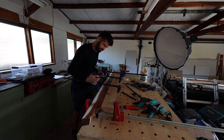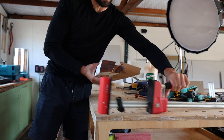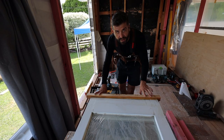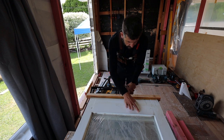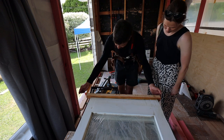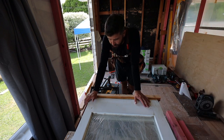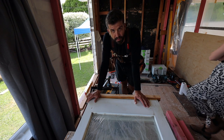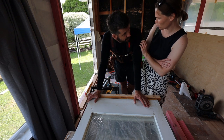It's had overnight to dry. Might be a bit soon but let's pull it apart. This is arguably even more experimental — this is probably going to fail, but it's my house so I'm willing to give it a try. I've added timber on the bottom here to extend the door because the door's too short. The timber runs this way, then this piece runs that way, and I've added a piece that runs this way. It's the same timber — it's cedar — and I have epoxied it on with screws and all the rest of it, so it should be strong. But there could be movement, and if there's movement you might see a crack along here. It's my best idea for making the door a bit longer.